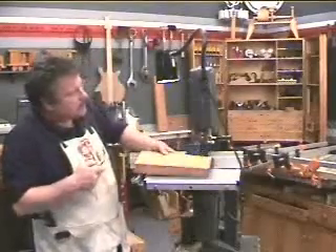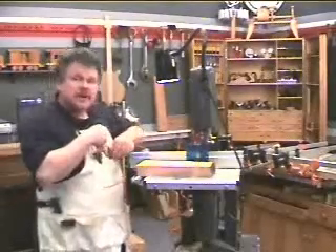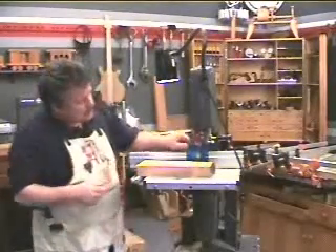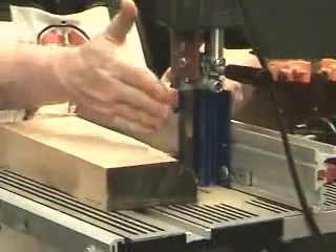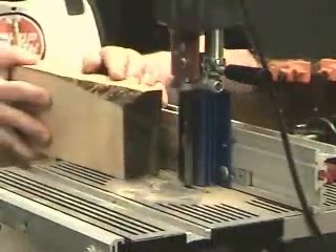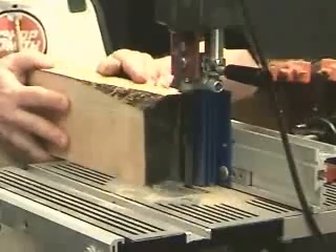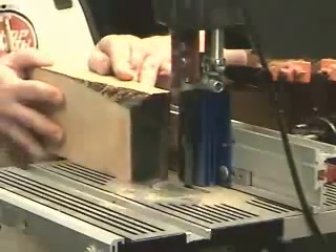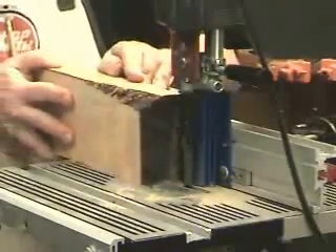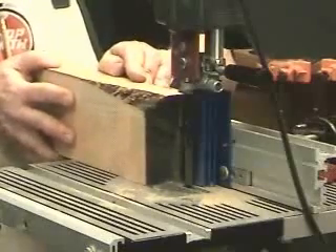I love the setup on the crank fence for re-sawing. There's a backstop right here, and it's got a curved surface on it so that you can feed the wood into it. And then I've got a line scribed right here, as you can see. I can follow that line simply by angling the board back and forth a few degrees.